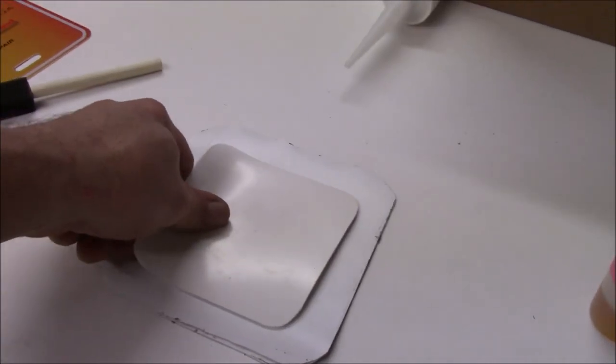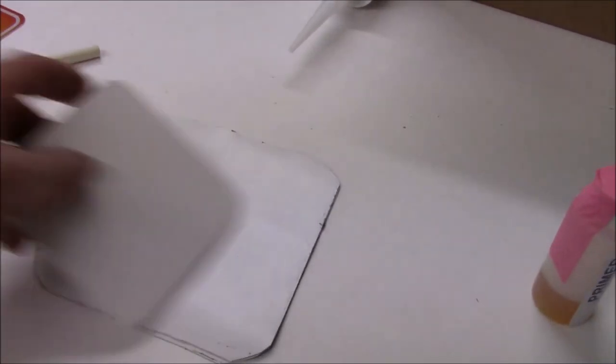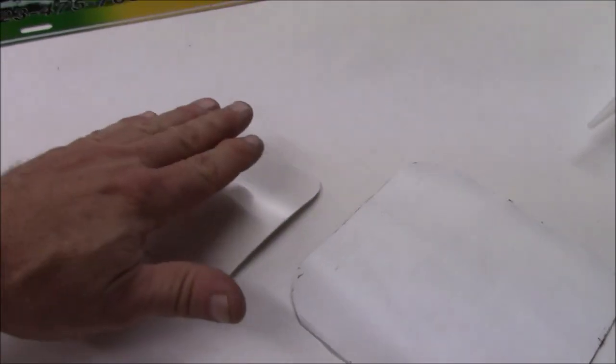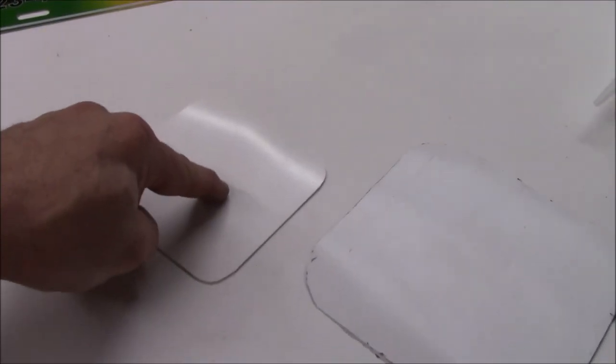If the customer really feels he needs a hot patch welded on, that's why we left the patch material. We do them for free if he can come back. You cannot interchange these materials — some people think you can. This is a Carlisle membrane, and it has to be the same Carlisle product. You couldn't take GAF or GenFlex and put it on there — they're two totally different companies and products. It's like Ford and Chevy: they're both trucks, but you're not swapping parts. They're not compatible, there's enough chemical imbalance between the products.